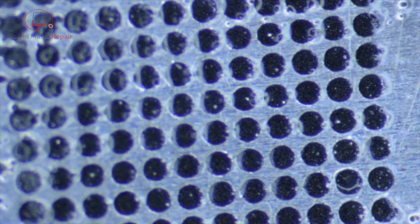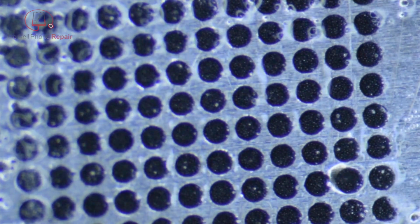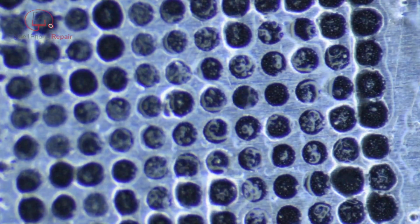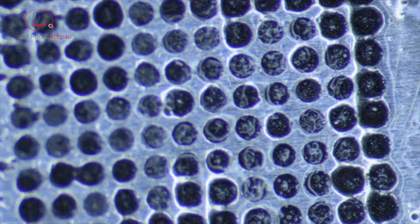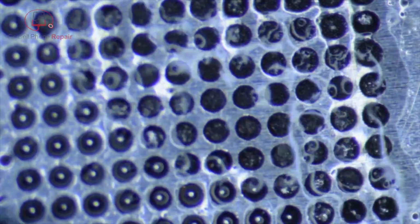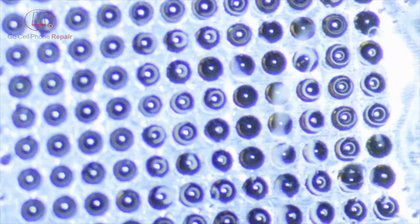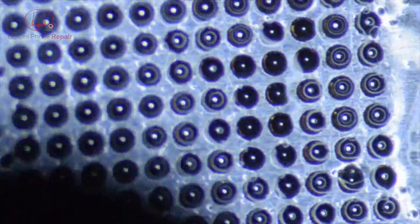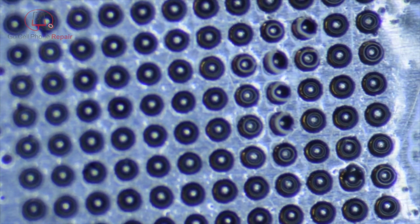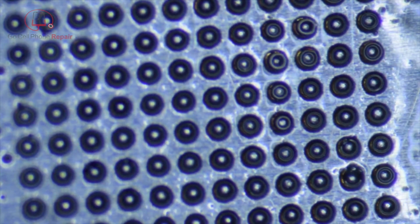And again, adding to the time on your project where you have to take that off, go in, smooth it out, and put it back on, and it's just repeat the whole process for all practical purposes. Now I turned my heat down to 325. I've still got my airflow on 30 here, and again, what you want to do is heat these nice and slow and evenly, and just kind of work your way across. And as soon as they melt, you can stop with the heat.